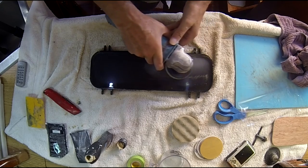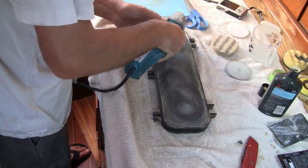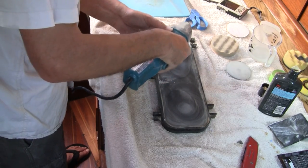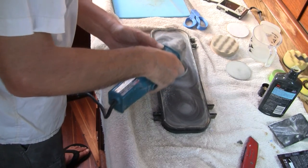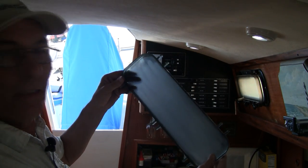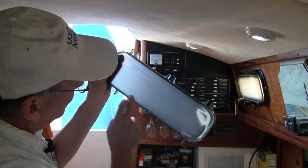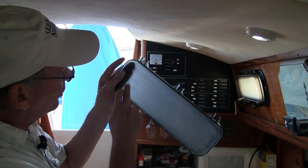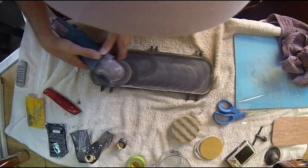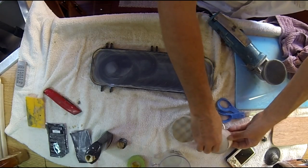With a clean port light and the 500 grit sandpaper, gently sand the surface of the lens. Keep the disk moving at a fairly brisk pace so that you don't sit in one spot too long — just gently move around, cutting the surface and removing any damage. It helps to hold it up to the light and look through it from the inside or the clear side so the deeper scratches show up, letting you see any areas that need specific attention. Once satisfied that all scratches and surface imperfections are out, switch over to a lighter grade paper.